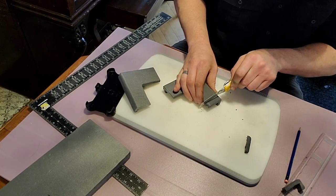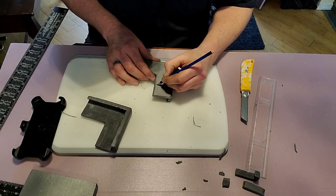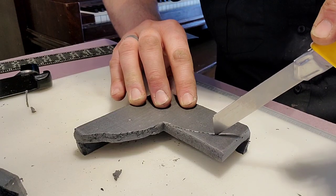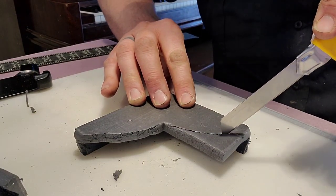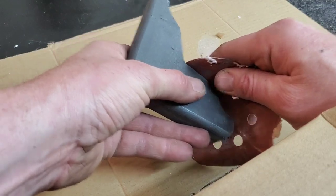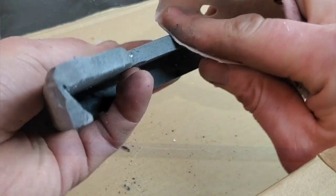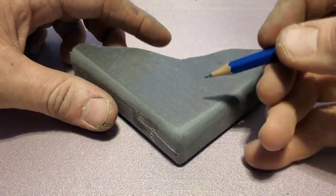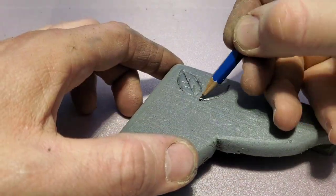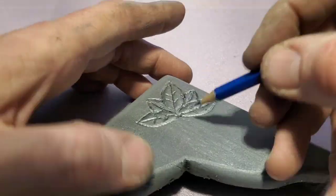It's amazing how close the castings will be to the foam if you coat them properly and spend the time. While I was marking this I was really surprised how the pencil was cutting into the foam — this gave me an idea. Rather than carving it with a knife, I could probably just draw on top of the surface and that would give me the detail I was looking for. We'll get this all cleaned up first. I paid special attention because the foam disappeared quite fast with the sandpaper. I found on a test piece that the direction you drag the pencil is important to give you a better imprint, and the pencil was almost rounded to an eighth-inch ball at the end of it.